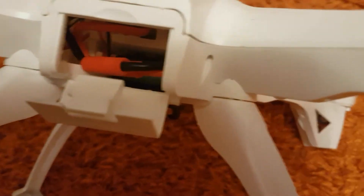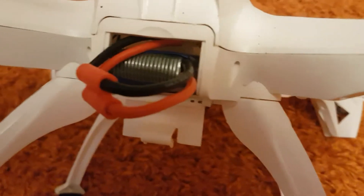There's one more point of damage on a quadcopter that people usually overlook: this little battery door here. It keeps the battery in. Lots of violent movements in the air, or even a few crashes, will wiggle the battery out of its bay. People might think that's fine, it's not fully coming out — but that's wrong, because the two connectors are actually soldered to the main board, the flight controller. If you keep flying like that, those solder points are going to weaken until the wires fall off, and then you're going to have to open the entire thing up and redo them.